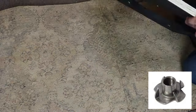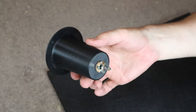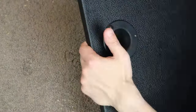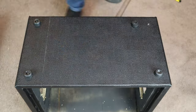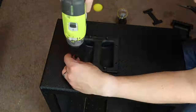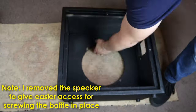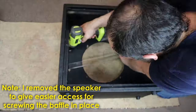Let's start by mounting the speaker on the baffle. You can either use screws or T-nuts to mount the speakers. To install T-nuts you need to drill holes for each T-nut and bash them into position with a hammer. Next, screw the jack plate into the back panel. I designed and 3D printed my own jack plate because I wanted mine to be recessed far into the cabinet so I can easily sit the cabinet against the wall without the speaker cable sticking out. Install the cabinet feet or casters and make sure you position them far enough from the edges to leave room for your corner pieces. Then you can install the handles and the corner pieces. It's a good idea to drill pilot holes for the screws to avoid splitting the wood. With the corner pieces installed, you can slide the front baffle into the cabinet from the rear and screw the panel into position.